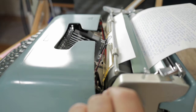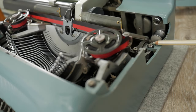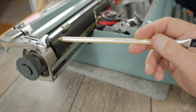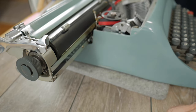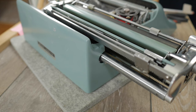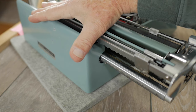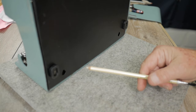Once the clear card guides are adjusted properly, you should be able to feed paper in and it should feed directly under the rollers without having to lift the paper bail. To remove the body shell off the chassis, take out the screw on both sides, then move the carriage fully to the left with the right margin adjustment fully to the right. This gives you room to lift up the right side of the body and take it off toward the left. To reinstall, fit the curved cutout in the left side around the round tabulator shaft, then fold the body shell back onto the chassis.